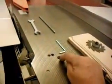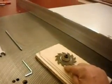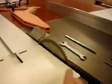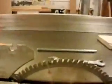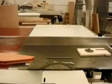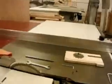And then, of course, you do have scoring, which is nice sometimes. You've got an up and down lock, and side to side on a conical type scoring blade. I don't use the scoring much because I tend to use a negative rake saw blade. High alternate bevel negative rake seems to work fine. And anyways, that's essentially the saw.